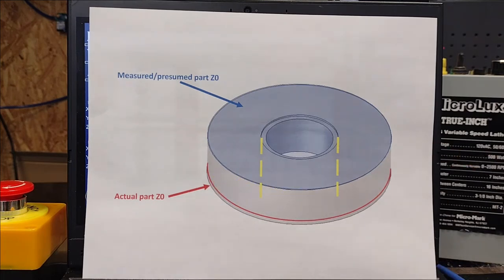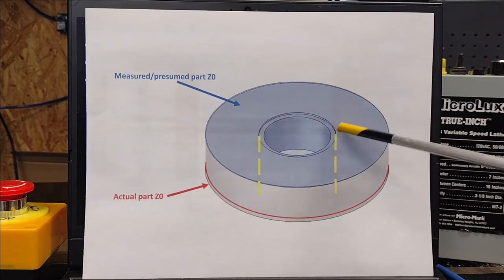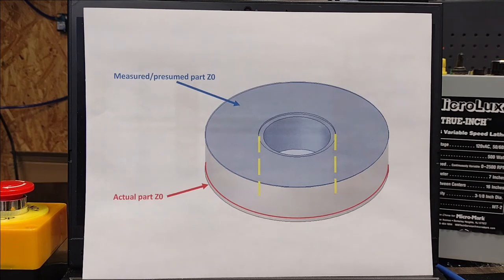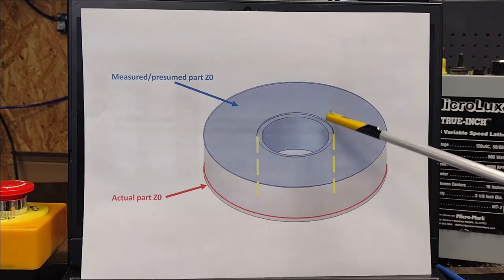And so that's why the tools are plunging down and just crashing into the top very ungracefully, because I had them set up to helix in on the cuts. And you could see that when I'm dialing in the fog buster, you could actually see the helix move. One of my head scratching moments was, why did it just cut a big hole, when the original design was to have an interior hole that was just under an inch, and then this little offset indented edge where the top spindle nut could then seat into. So it had clearance for the diameter of the round spindle nut, and also a little bit of depth.